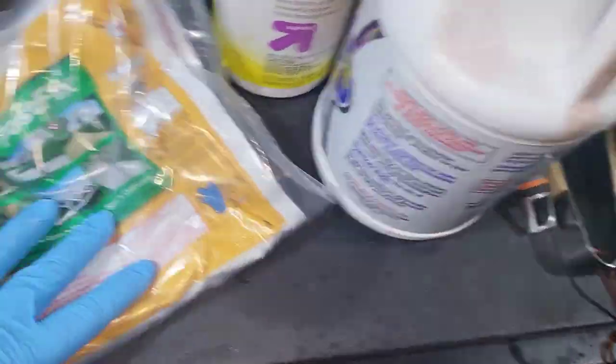Day three — we're back. We measured: accounting for the sill plate at inch and a half, we got five and a quarter inches of fill from when we poured it yesterday. You can see some foam sticking out — it's pretty hard. We didn't get much rise. I went and bought three more bags — a different brand this time. Let's mix it up and see how it goes.